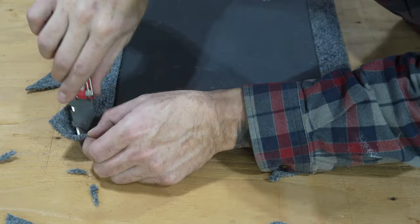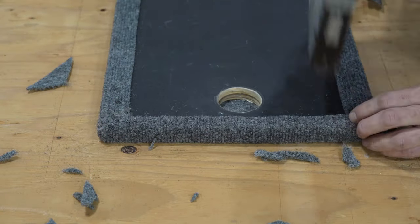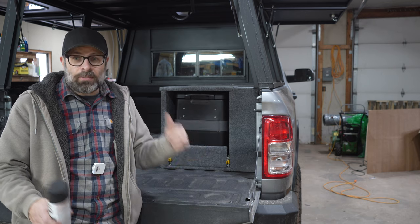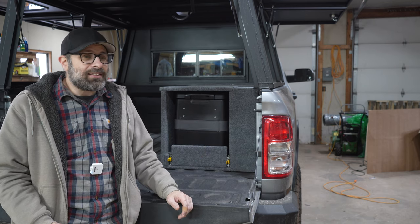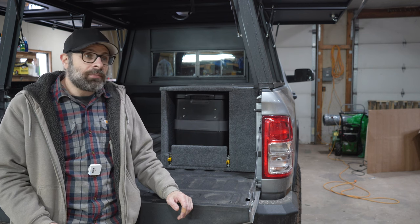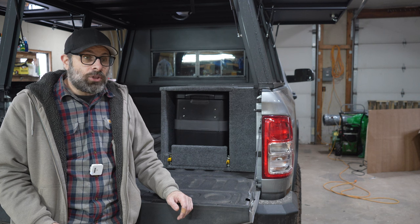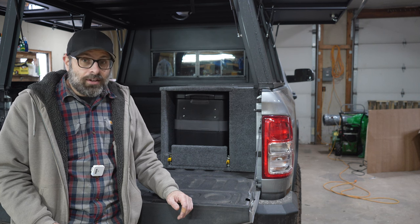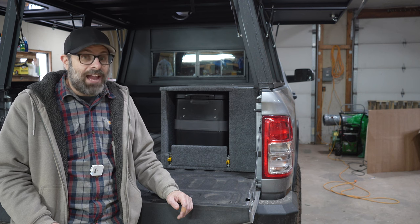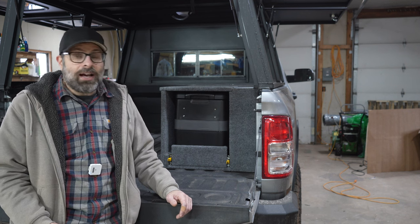Carpet is a little tricky. Really pay attention to how I did those corners. You've got to use glue — carpet glue. Roberts, I think $6 to $7 is the number. They sell it in a small container. It's definitely the hardest way to do it. Can you use contact cement? If you're careful, yes. Contact cement dries a lot quicker, so you've got to be dead on when you put that thing on there. Spray it on the wood, spray it on the carpet — you better be right. And then obviously a staple gun.